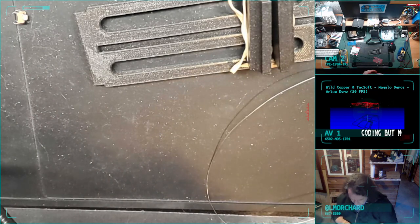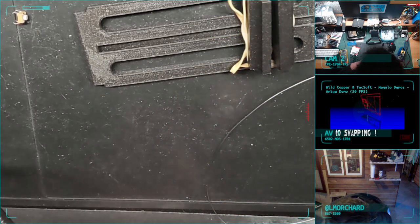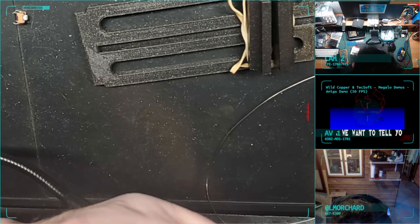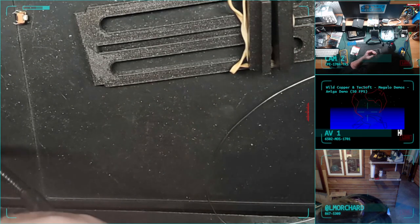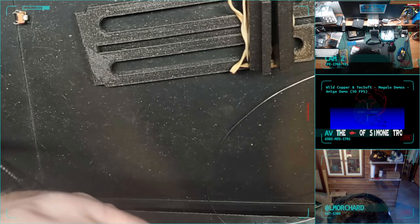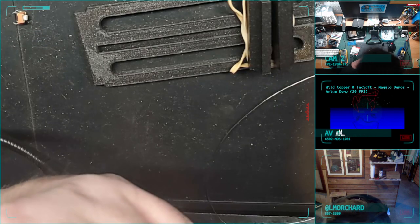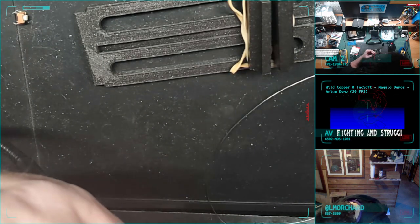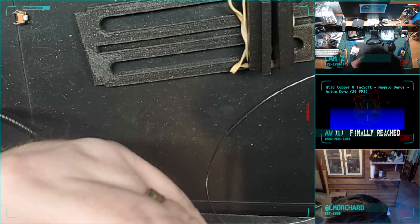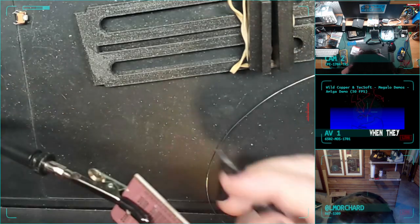Kind of trying to make sure each of these pins has a good connection, because they're not even pins, they're just pads, and we're bridging solder down to the bottom. And it's physically awkward to test this. I'm kind of trying to focus on the pad on the component and make sure it's got through to the bottom, which is probably fine. I just never soldered this kind of thing more than twice, so I'm pretty sure.